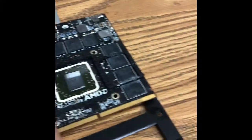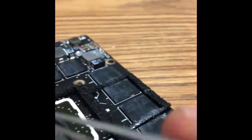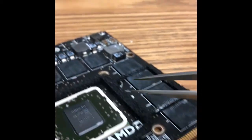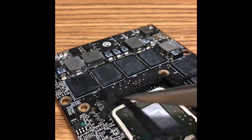The trick to this fix is that the solder joints on this video card have heated up so badly that they are disconnected and you don't get a picture. One trick is to put the card in an oven at about 200 degrees for about 10 minutes. Remove anything that's plastic first.